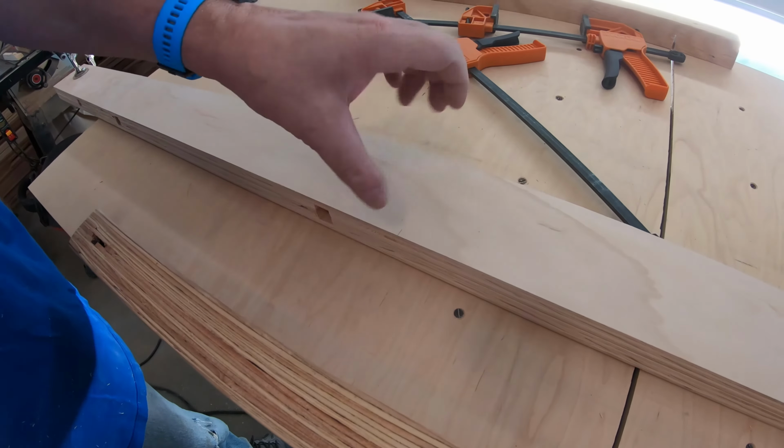What we've got over here is our drill press, and when we did our mock-up, we did a test hole. We want our distance here to be about 1/4 inch back, and I can adjust that with this. Once I set it, I'm going to leave it, because we want them all to somewhat match. You've set it so it doesn't go all the way through. It stops. So it'll go through one board, but not completely through. See, it'll stop there. So it won't go clear through.